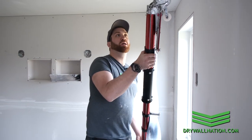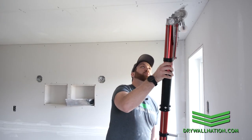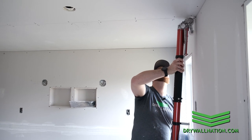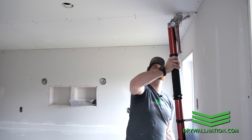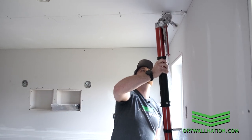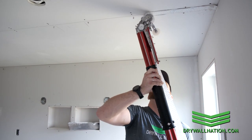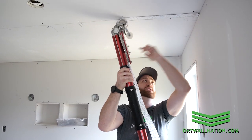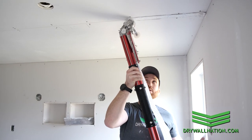Now we're going to start on the ceiling. I'm going to charge my head — you can see the mud coming out the top there. I'll advance myself a few inches. With ceilings, it's important that as soon as you have enough clearance, you want to get that creaser wheel pushing the tape tight to the ceiling, then you can let go. That's to ensure that as you start moving along the rest of the seam, it doesn't come loose and fall down and hit you in the back of the head.